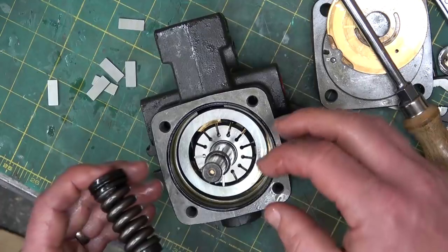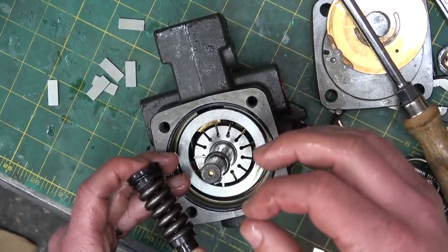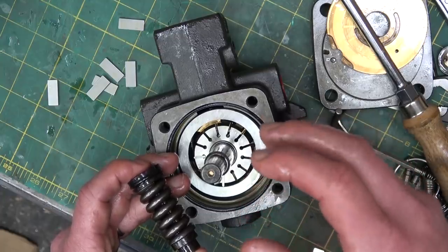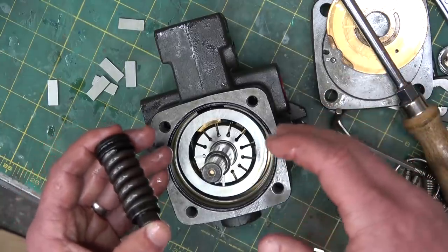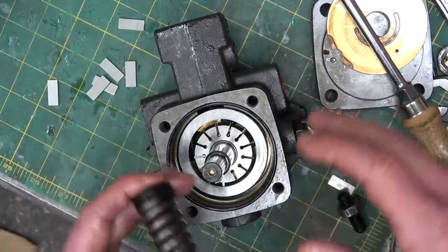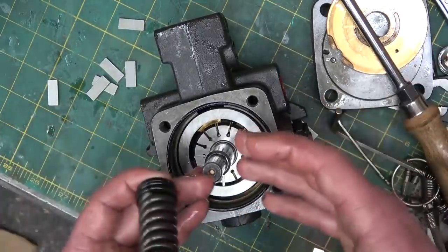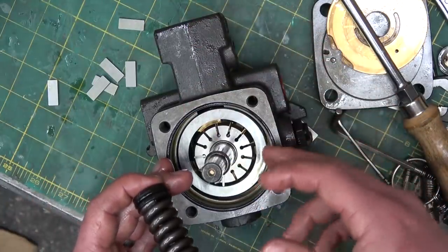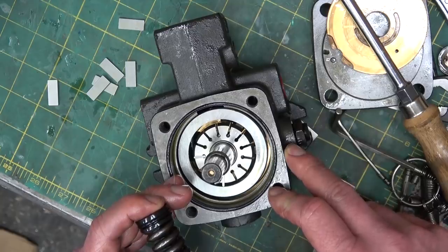This kind of pump is pretty good at having dirt in it — not as good as a gear pump, which is essentially bulletproof, but far better than a piston pump. For dirty applications with pressure compensation, this is the way to go. I mean, 73 doll hairs.